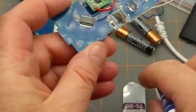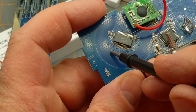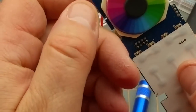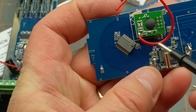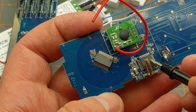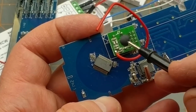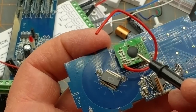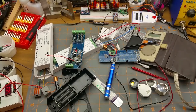And this one up here, you see these little tracks going out from it in a sort of a circle around? I'm going to guess that's the touch sensor controller, decoder, brain box, which will probably communicate serially over to here, and then there'll be a serial line, I'm guessing, running up to the little transmitter. Oh, not even a chip, it's just a blob. Man, these guys really don't want anyone to find out their ancient Chinese secrets, do they?